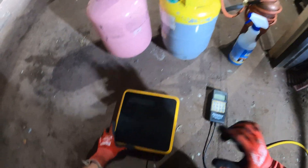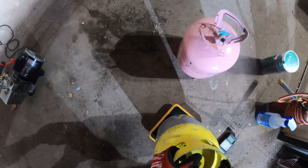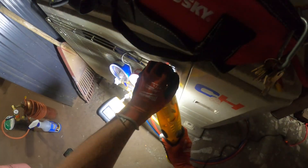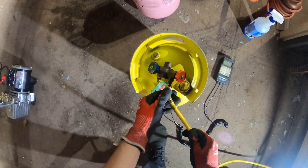When it comes to these inverter units, you really want to weigh in the charge. Let's see what came out of here. On the unit itself, on the nameplate, it's going to state how much refrigerant is in here. It says it's 410A, 82.9 ounces. So I'm going to weigh this in for a proper charge. Let's start this bad boy up and open up the tank.